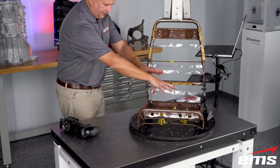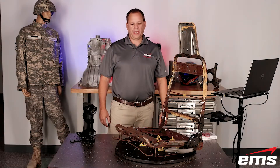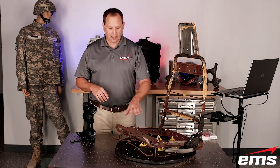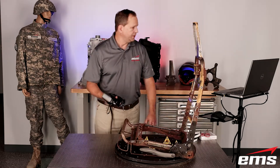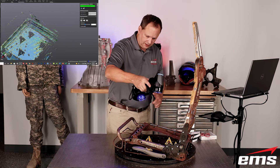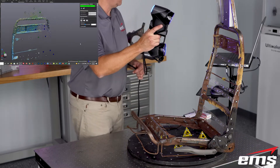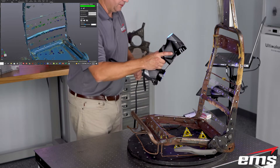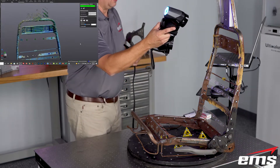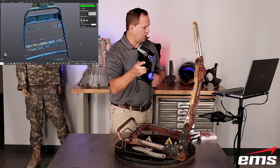That should give us enough in the middle. I've got plenty down on the floor with the table, so let's try this and see how it goes. Now we are ready to scan. We've got our Speed Target tape, we've got normal targets, the little triangles, and of course the rotary table. Now it's business as usual — we tell it we want to start scanning and pull the trigger. I'll start down here. You could pre-scan the targets if you want, but watch when I move up here — you can see I can easily move across the whole part and pick up the scan data. There's still some foam left on this frame, so you'll see some areas that look pretty rough. That's just the seat foam — this was an old seat we'd taken apart. But you can see with these targets, it picks it up.